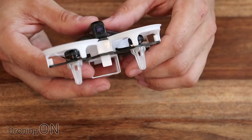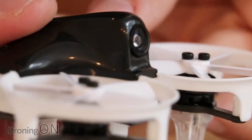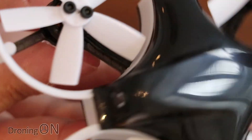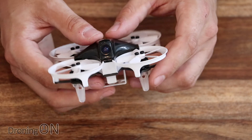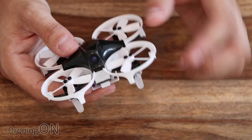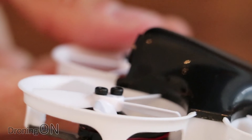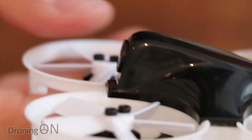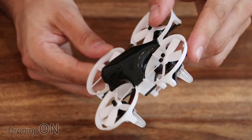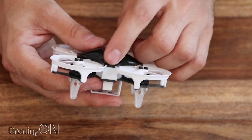Starting with the front, we've got the little camera. It is a CMOS camera — unfortunately 800TVL — and the lens is 170 degrees FOV. That's very broad, but this is designed for indoor flying where you need quite a wide FOV to get through a house in one piece. It's possibly a bit too wide for me, but we'll see during the flight test. One thing to note is that the camera is not tiltable — it's fixed at about a 10 to 15 degree angle, which is a shame because with the brushless performance, when you build up speed all you're going to see is the ground.